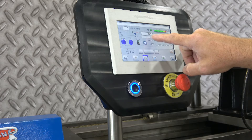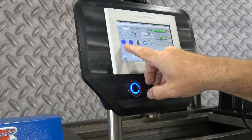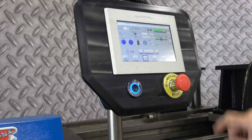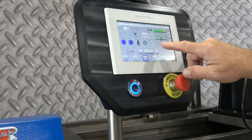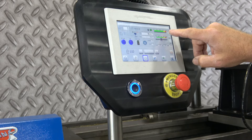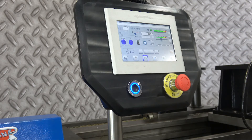This bend will be 90 degrees plus 15 degrees spring back. These two little blue toggles — you can turn the type R switch on or the pressure die switch on. You can turn the steps off in the cycle to move it manually. It has a cycle count, a load meter, and a program speed selector. You can increase the speed in the automatic program as you're going if you'd like to go faster or slower.